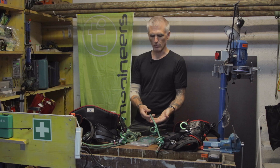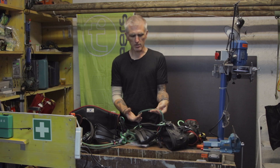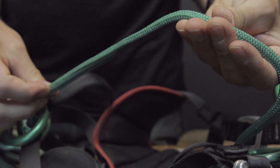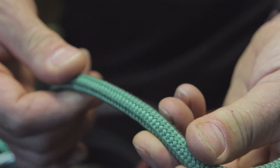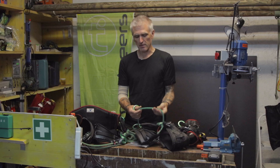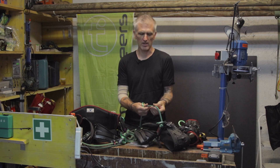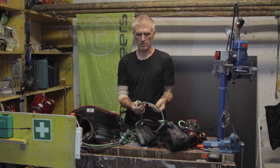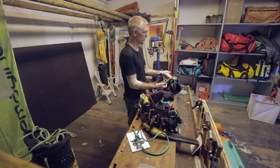The other thing you can do is contrast and compare. On this harness, you can see there is an aluminium deposit from the ring running on the bridge — this grey deposit — while the other side is as new. Of course it's not new because it has seen service life and flexing. But it does allow you to compare the two sides and get a feel for whether there has been abrasion. This is a normal wear pattern and is no cause for alarm — it's just what happens when you get hardware running on textiles.